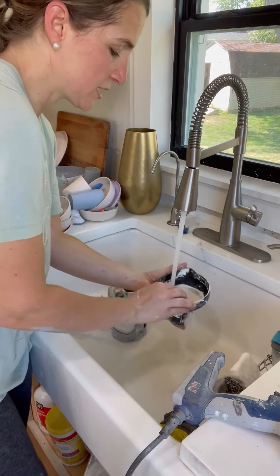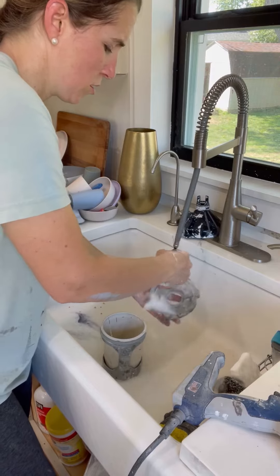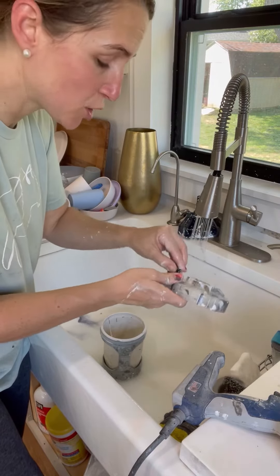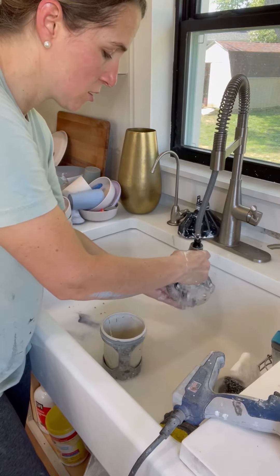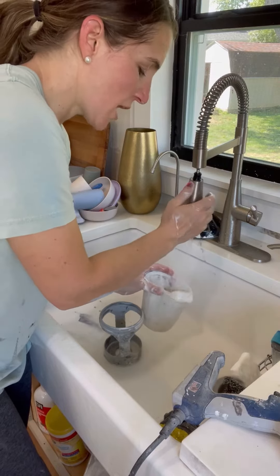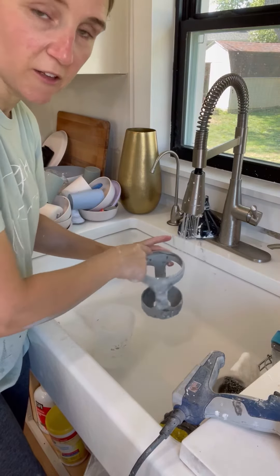Mine comes with this little strainer and the drain — I rinse all this out. With this lid, these sprayers come with a little tiny hole where the air escapes. You always want to make sure you rinse the paint out of this part too. These cups are disposable, but I usually keep mine and use them for about five uses before I toss them. If there's any paint around the rim, I'll make sure to get that off, otherwise it'll affect the seal.